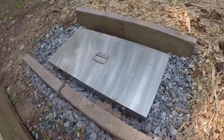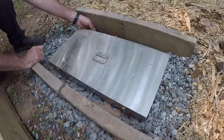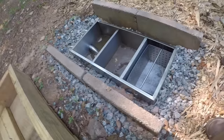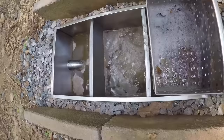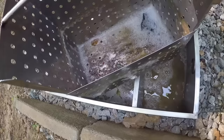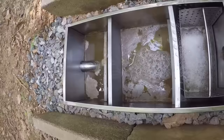All the liquids from the toilet and the hand washing station travel via a common one-and-a-half-inch PVC pipe into a mixing and settling tank — a 15-gallon stainless steel watertight grease trap like those used in commercial kitchens. In our case, it dilutes the urine and captures any solids that get into the wastewater pipes. Water enters on the right, goes through a strainer basket, then through two baffles, and finally out a curved pipe on the left, from there into two 20-foot-long septic lines. The wastewater in the grease trap smells bad, but a sealer on the top prevents odors from escaping. Urine-soaked feces are responsible for the noxious smell in porta-potties and pit latrines, so separating the urine and directing it into the leach field is essential for a pleasant-smelling outhouse.